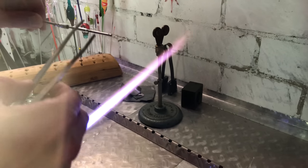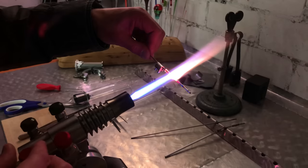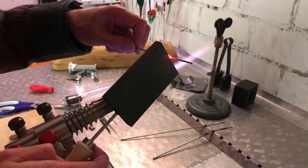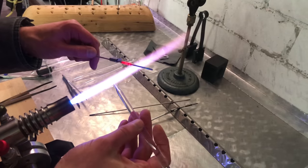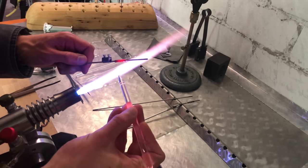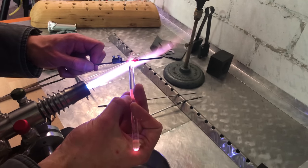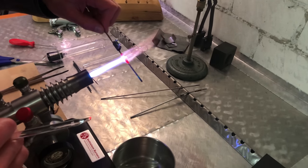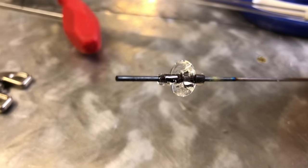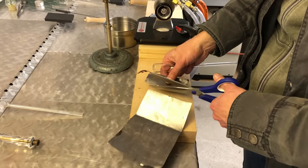A thin glass tube was then fused around the electrode and a glass bead was attached to it. This bead will later facilitate connecting it to the opening in the flange. Since one would not be able to hold the very short glass tube with a flange, a second suitable glass tube is wrapped with graphite paper and pushed into the flange.